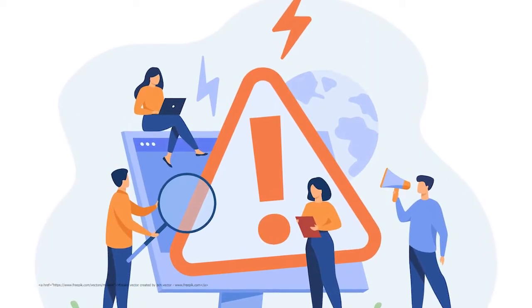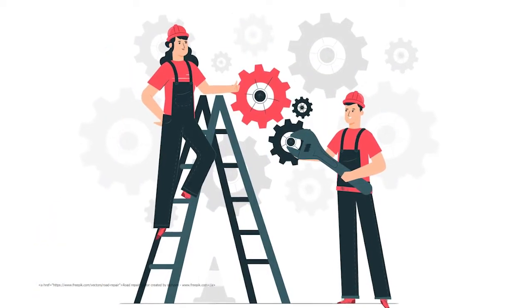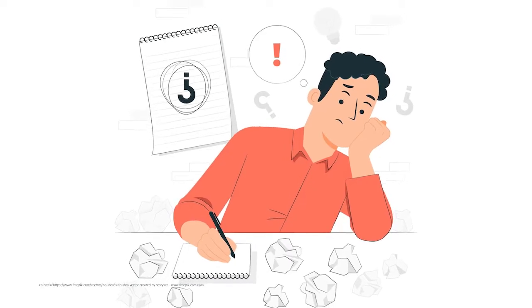The issue we faced is we designed a mechanism structure which is not rigid enough. Movement in one axis is affecting the movement in the other axis. That's where the design, we can say, failed.